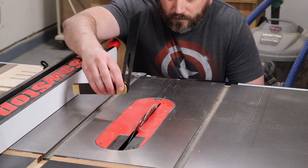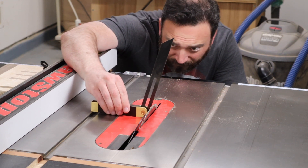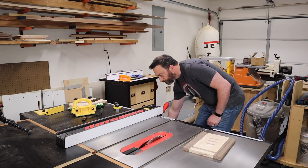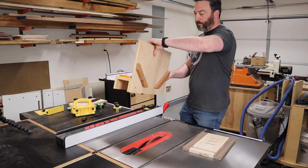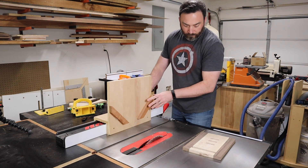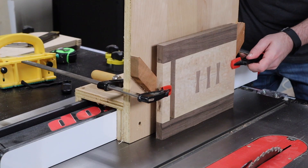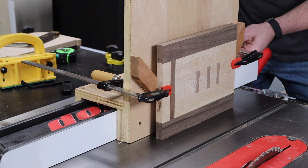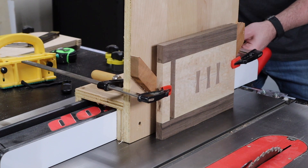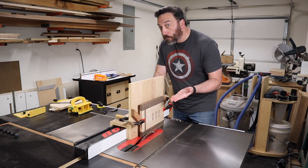To keep this piece from looking so blocky, I'm going to add some large bevels to the sides, and the best place to do this is over at the table saw. It can be tricky and somewhat dangerous trying to make this type of cut using just your table saw fence, so I'm going to use my miter spline jig that rides along the fence to secure the workpiece. Once it's clamped in place, it's perfectly secured so I don't have to worry about it tipping while I'm making the cut. This also allows my hands to be behind the jig and far from the blade while I'm making the cut.